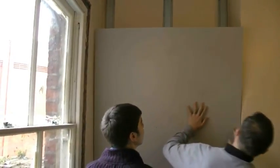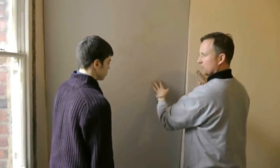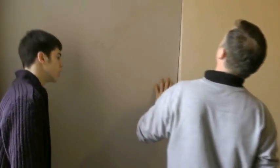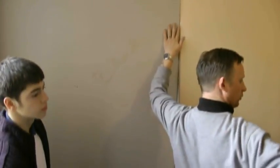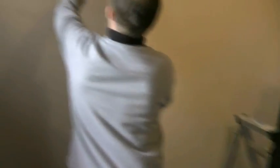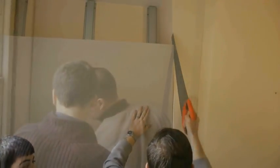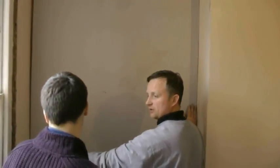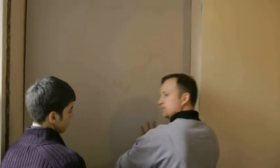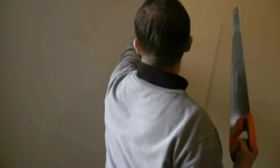The chimney breast is a bit tight — he's got the saw. You've got to remember the walls are all out of alignment. If we get a saw I can just take it out once. There's a wall coming in and out, usually quite a lot — can you see that? It doesn't matter so much this side because there's going to be another board going in there. This side is the most important. You line it up first of all to make sure it fits, then do all the measurements afterwards.